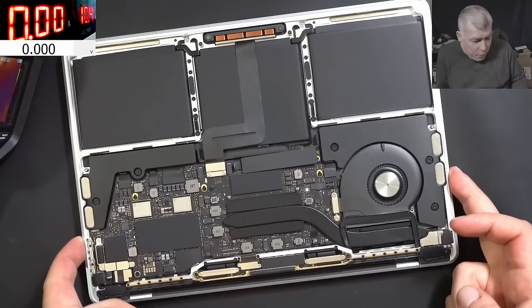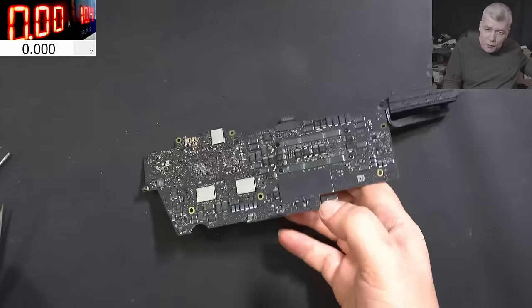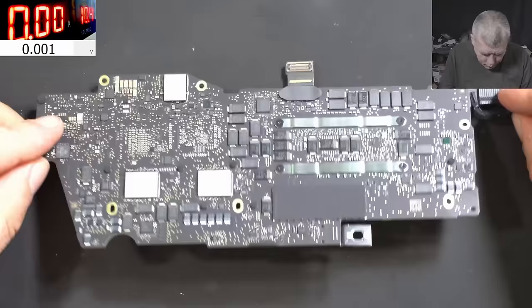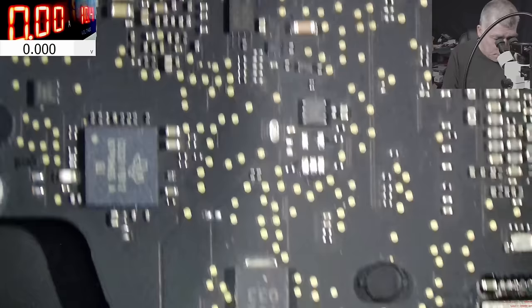This can be a lucky customer. Based on the resistance, it's looking like a shorted capacitor to me. But let's see - let me take out the motherboard and we can check. The motherboard is out and it's looking good. Let's try to pay attention to the area where we've seen the heat. It was somewhere here on this side. Something is dodgy. Let's go under the microscope and check together. I'm not sure what can be here, but I'm thinking probably it's the big one - though I'm not sure about that.